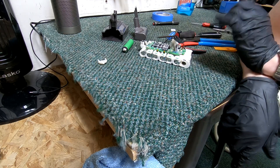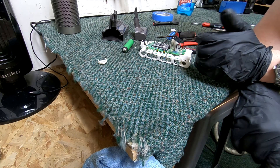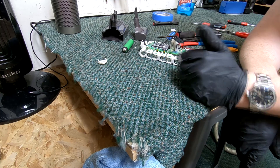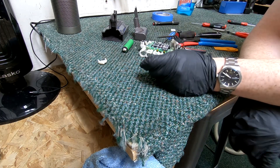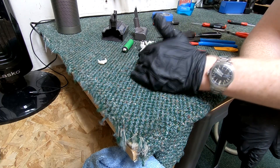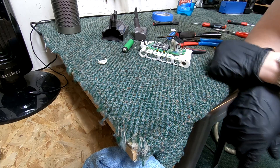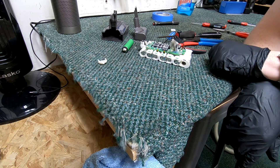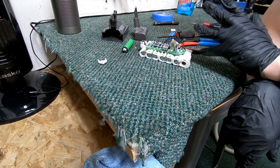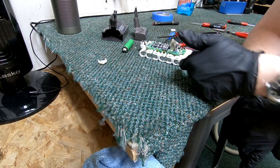The other thing is: this is a battery pack wired in series, meaning all the batteries are essentially stacked end to end. If you take one link out of that chain, it breaks the whole chain — so all it takes is one of these cells to go bad and suddenly you're stuck with a battery pack that does not work.